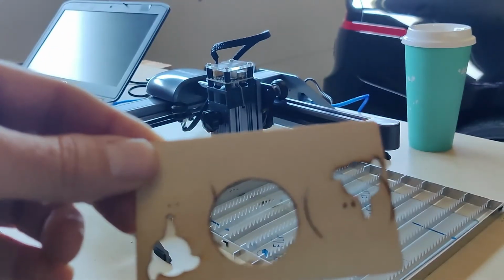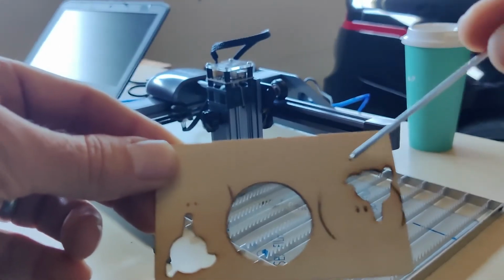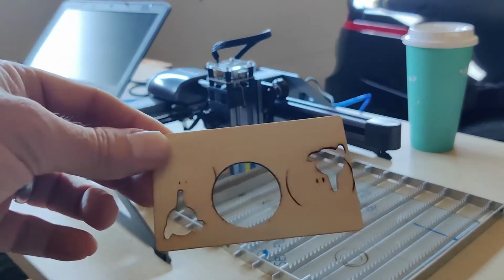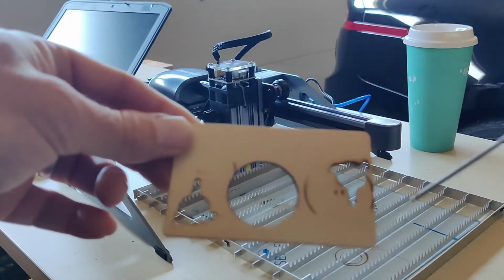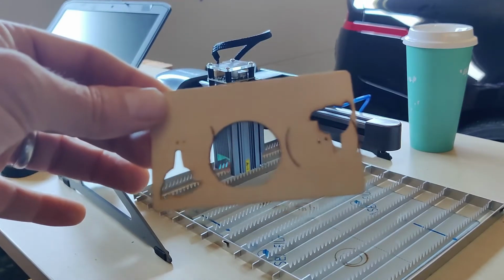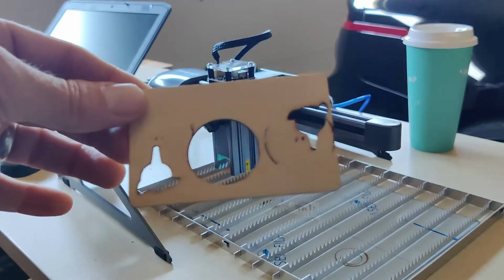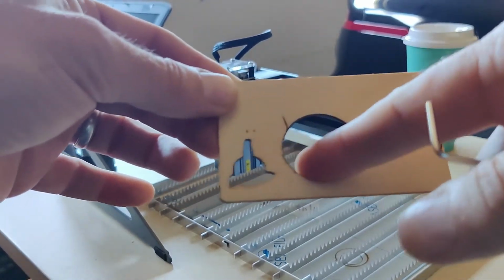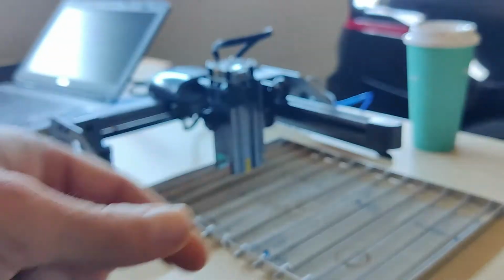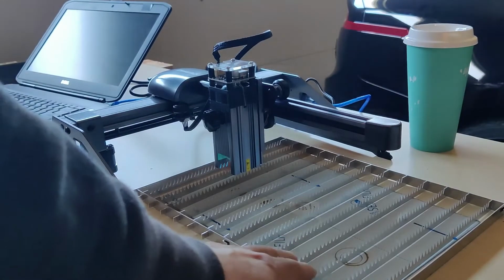Then you get over on the back and you can see what's going on. So you have some portions where the laser power is greater, either horizontally or vertically, whatever. Sorry, let me back this out. And so it would cut through partially and not the other side. And again, this is no joke, 15, 20 passes at 100% at something like 10 millimeters per second. I did finally get a couple to cut out, but for the large majority, it was difficult. Some of the smaller pieces, I was able to get cut out.